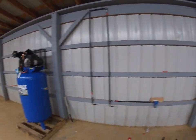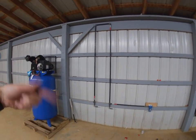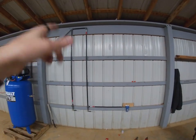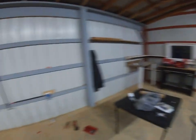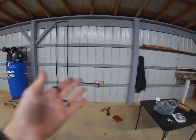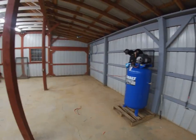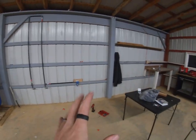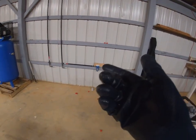That's pretty much how the setup is going to be: compressor, about 25 feet of line — might get a longer whip hose so it can coil to add more length — drain, drain, dryers, and then air running to where I'm going to be painting. Air tools anywhere else. I can always add more at that union — that's why I'm doing a whip hose, so I can tee off if I want to run anything else. You can cut and re-thread these lines so you can do pretty much whatever you want with them.